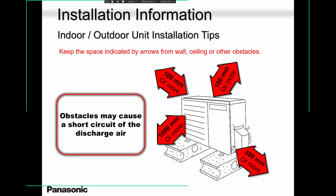And please keep this in mind, guys. Based on my experience, above 12,000 unit, do not install on a wall. You will hear it right inside. It transfers to the wall, to the copper pipes, you name it. Please mount these units on a stand.